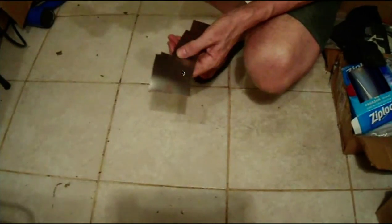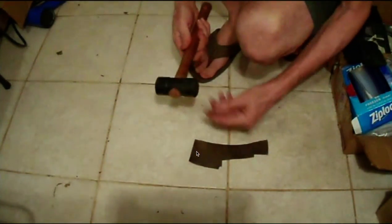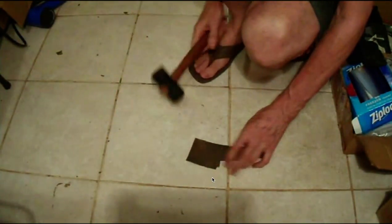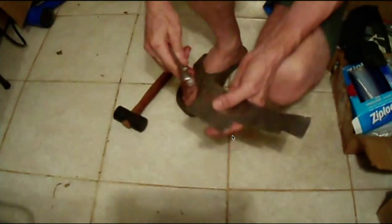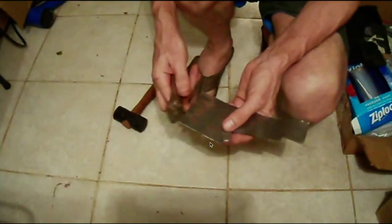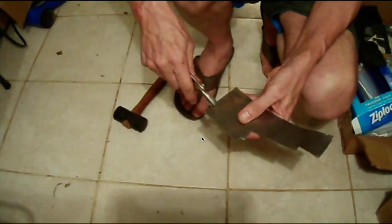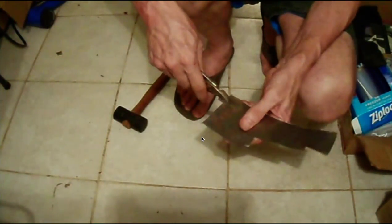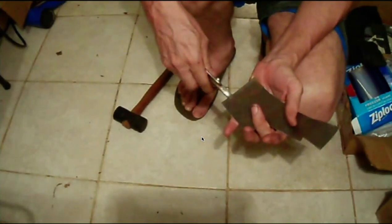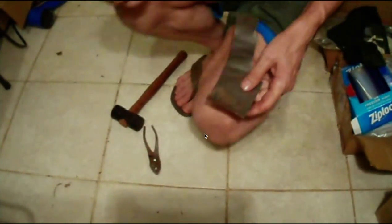This is an example showing using some scrap metal. You start off by beating it flat because it'll come out a little bit irregular after you cut it — some curvatures along there. The edges will need to be curved with pliers, just a little section at a time, to get a nice smooth curve. How much you curve it depends on what the final diameter of the section will be — the larger the diameter, the more gentle the curvature.